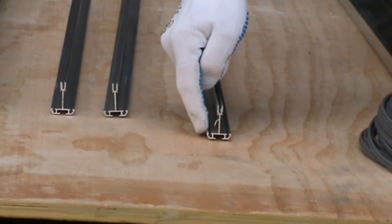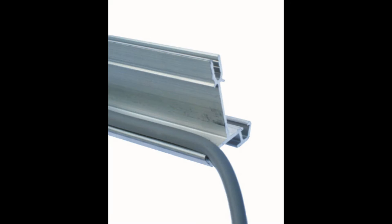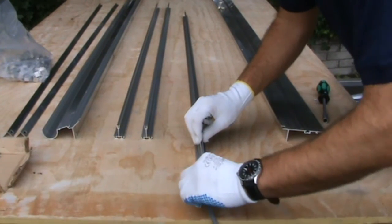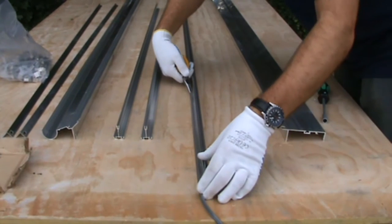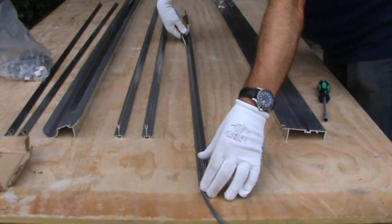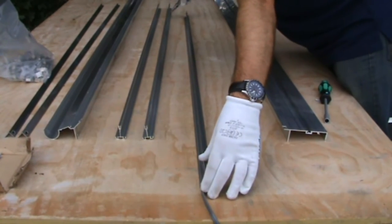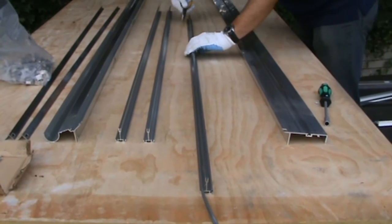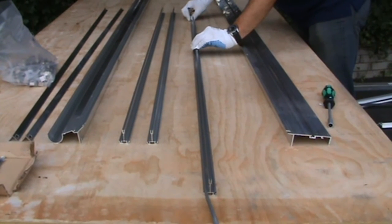There are two places the neoprene beading needs to go. The arrowhead of the glazing bead slides into the V-grooves of the glazing bar. Using the long nose pliers, drag the neoprene to the end of the bar. Leave a couple of inches hanging over the end of the bar, just in case it has been overstretched. With a pair of scissors or pliers, cut the ends of the neoprene off.